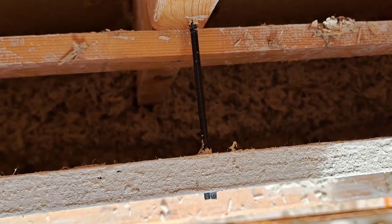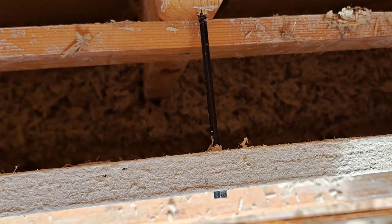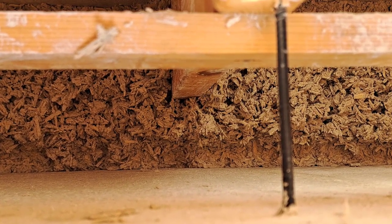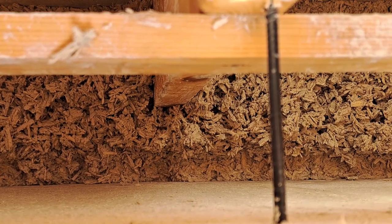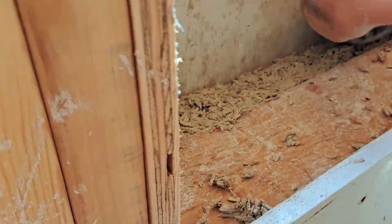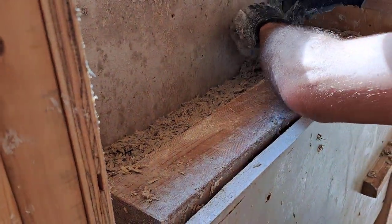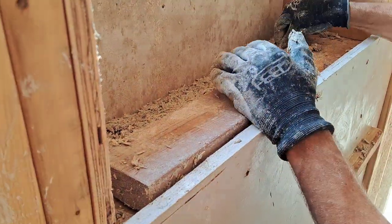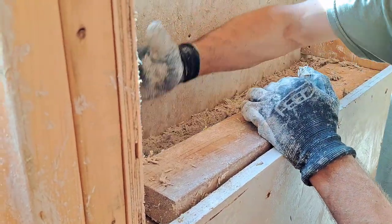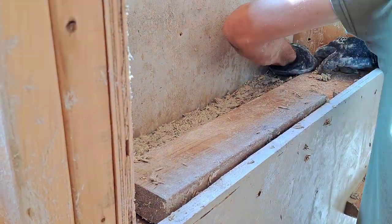Let's talk about sides of the home for a second — that's a south-facing wall over there and we've got a north-facing wall here. Drying time capabilities differ too, because this north-facing side will be a much colder face of the house. On the south side we've got the tallest hempcrete structure at 11 feet, with wide-open glass windows to get that solar gain coming into the house. This north wall will keep it cool during the day, and at night it'll collect heat and disperse it to keep it warmer.